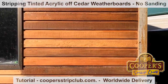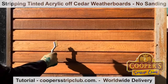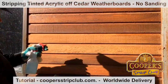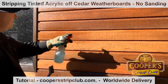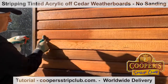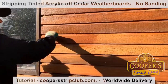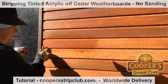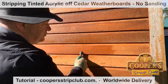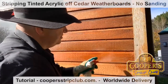What we're going to do next is rinse the surface. We don't like water or anything that contains water because it's a grain raiser. Got a clean brass-bristled brush - not too coarse, we don't want to tear the wood apart. And we've got our blue one this time - this is our flusher. We're spraying and scrubbing straight away. We don't leave it like the stripper. It's ideal to flush while the residues are soft because it's easy that way. We know if someone's not flushing straight away because they run out of flusher and ring us for more - they're probably leaving flushing to another day, and all those residues go hard and it takes way more flusher and elbow grease.